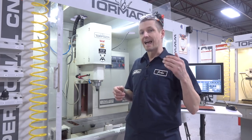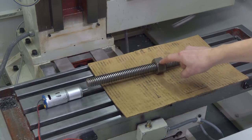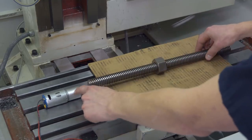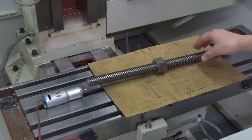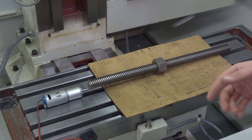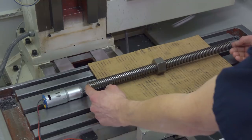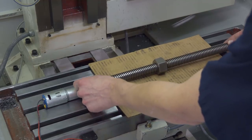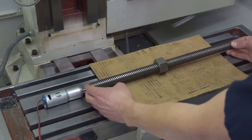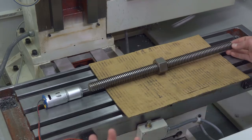What I want to do now is take a look at the angular contact bearings. So what are those? The ball screw is in our machine, the ball nut, and then we've got our motor that drives the axis — these are coupled together. When the motor turns, it turns our ball screw, and that changes the position of the nut left to right. The table is fastened to this ball nut, and that's what causes our x-axis motion. The angular contact bearings live on the left side of our ball screw and they preload this whole ball screw shaft, so that when we start to rotate the screw, it looks for the path of least resistance. If there's any slop in how this screw is mounted, that's going to move, which could cause our table to bounce back and forth.